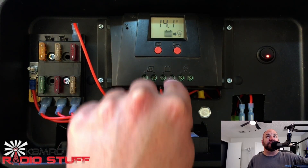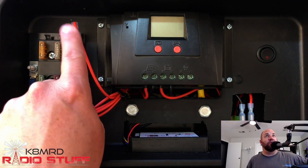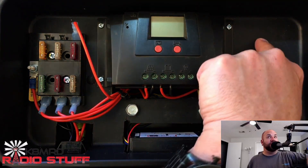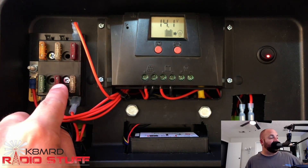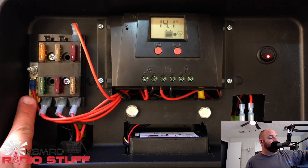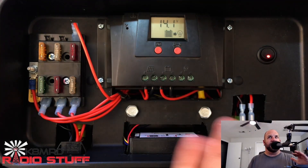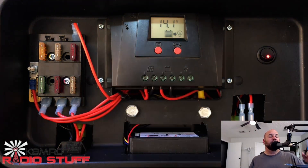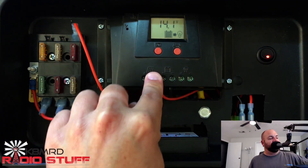From the battery connection there's a switch — the only reason I have a switch is because if a battery is plugged in without one, it always stays on. From that switch, there's a wire connected to a fuse. So even if the battery is not hooked up and I just have a solar panel connected with power coming in, this whole thing is energized. This post right here is where the battery positive connects.